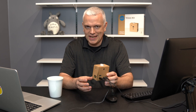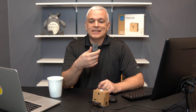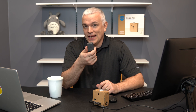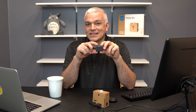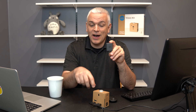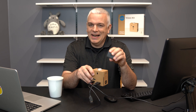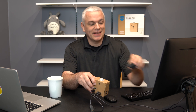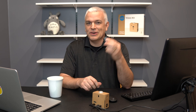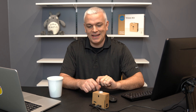The very first mistake I made was I used a recycled power supply. This one was only 1 amp, but I needed 2.1 amps. You'll see in the guide to building this AIY Vision Kit that it needs 2.1 amps or greater. I made a bad mistake — it caused my Vision Kit to fail. I had to take it back to Target and get a new one. It seemed to work at first but it wasn't until I started programming that I came back and it was just dead.